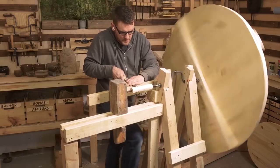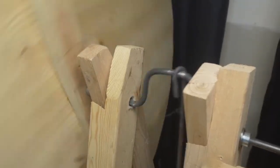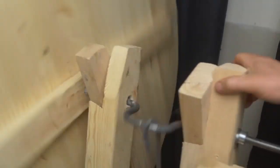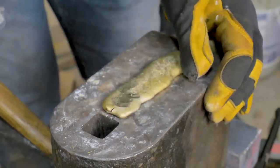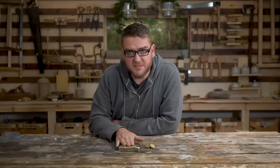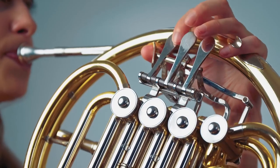The DaVinci lathe I made in our last video has an issue where the metal shaft, when spinning, sits inside a wooden hole and gradually makes that hole larger, throwing everything out of alignment. Being able to use brass to cast simple bearings is going to be a bit of a game changer for these machines, and as we start getting into more complicated machinery it will be absolutely crucial. Once we get the hang of cold-working brass, it really opens the door for making sheet metal out of brass, which can then be easily turned into a lot of different tools or possibly even some instruments.